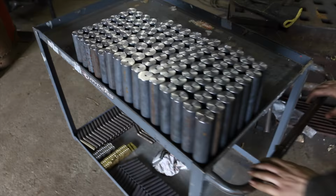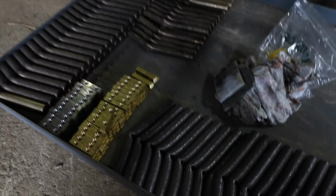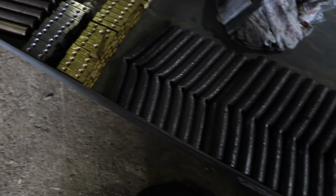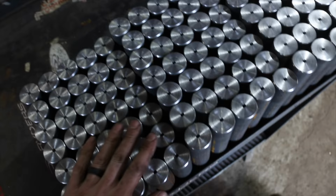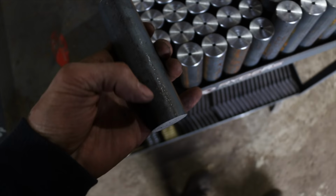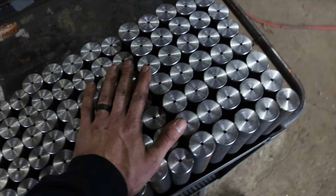This is some of our production work we have on the go. So these down here are gonna be these hooks making for a company for lock and mortise. It's hard to tell, but these are actually bronze right now. Those have quite a bit of work to be done with them. But anyways, today, this is what I have to do. So these are actually candle bases. And maybe you've seen these before. This is a company in Vancouver called Barter Design, and these get upset. This is 1.5-inch round bar, and so this is where that pair of tongs is gonna be critical. I've made probably over 1,000 of these things, and those pickup tongs are just the sweetest thing for this. So let's get the hammer running and try that pair of tongs out.